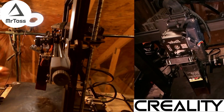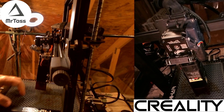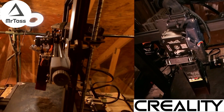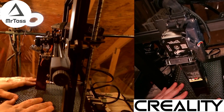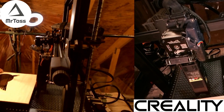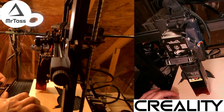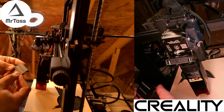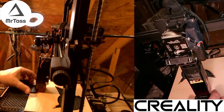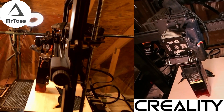I purchased a third-party air tray, designed to let the laser pass through with less smoke so your prints don't come out with quite as dark or burnt edges. Before you level, you need to take into account whatever you're going to put underneath, including your material. So we put the air tray under here and then level. If I was cutting this 2mm basswood plate, I use the little step level — it says engraving for 1 to 3 millimeters — drop that on there, then re-tighten the thumb screws. Now my laser is at the correct height to print through this material.